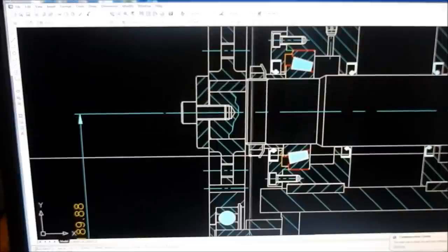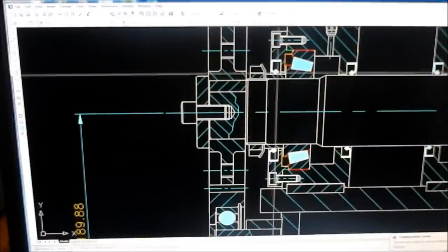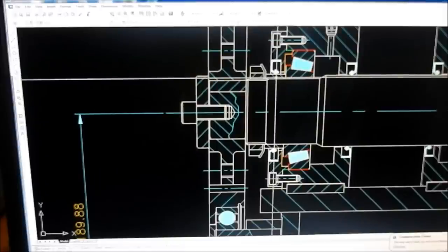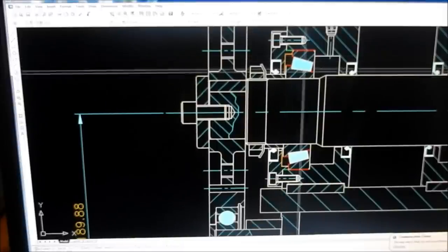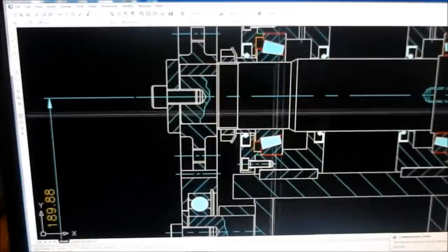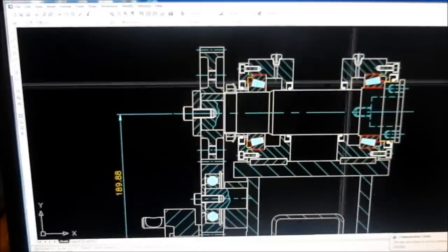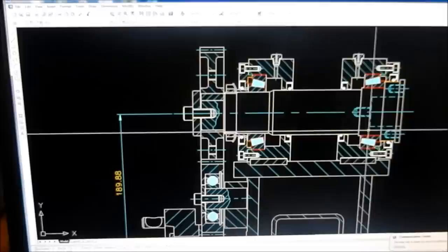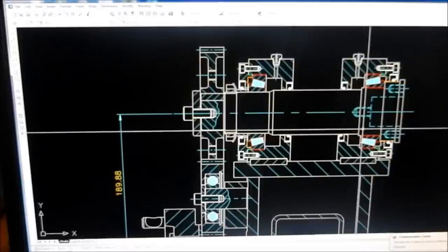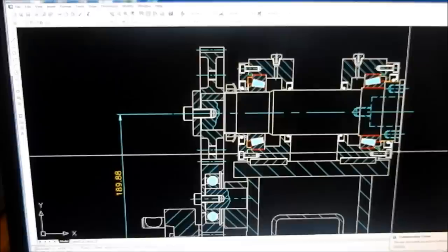Just a standard nut on the back there. I've just put a dummy seal bush in there just to push up against to set that clearance quite comfortably on those Timken bearings. I've done these as being oil filled, so they're permanently lubricated, filled with oil, with a level screw on the edge so that I don't overfill them. Makes it easier if you've ever got a greaser who's filling up gearboxes and stuff like that, if you give them an indication as to how high you want that level.